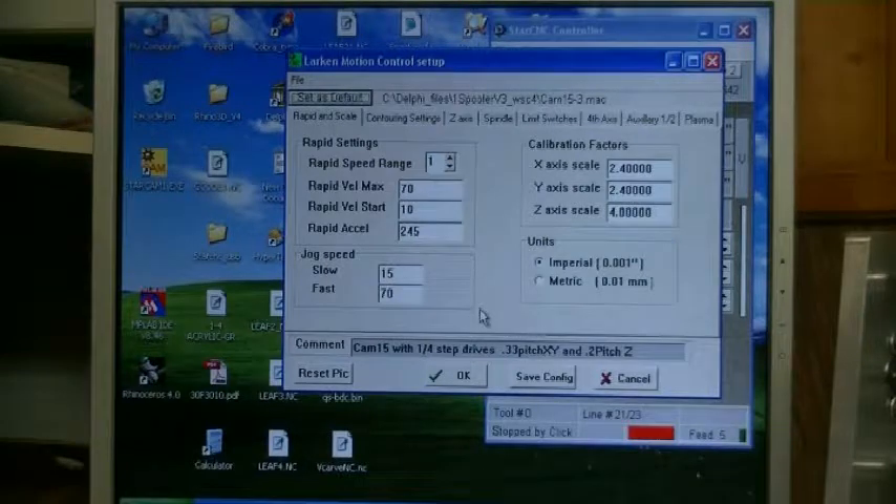The configuration is all the parameters required to run the machine. If you change it to metric you need to change the scale factors — in metric it would be the number of steps it takes to move 0.01 millimeters. There are mostly pre-made configurations: CAM 24 inch, CAM 24 metric millimeter, CAM 24 closed-loop servo SV, and so on. If you're not sure, just call us at Larkin and we'll tell you which one to load. It's important to set your configuration file correctly or your machine won't cut the right size. The machine will run with pretty much any configuration file, but it just won't run the right size.